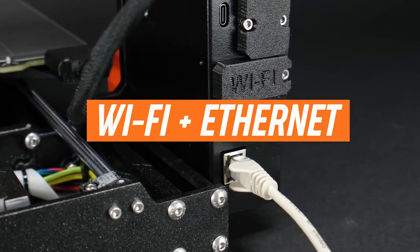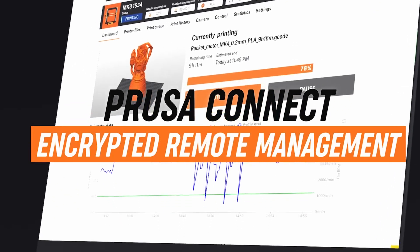Another feature that sets the MK4 up for long-term success is the built-in WiFi. I know people will roll their eyes saying you can add WiFi — I understand that; I ran Octoprint on my Creality Ender 3. But just having something out of the box that's first-party, the Prusa Connect feature, is great. It solves the need and keeps me from having to have a separate server running at all times. It just runs with the machine and in the cloud. It gives a very good user experience — though it's definitely still in beta, a little wonky. The camera feature only supports an old tablet, phone, or notebook, and it's sending snapshots every 10 to 30 seconds rather than a live view. But I think it could get there, and I overall like the UI and the fact that it just works out of the box.